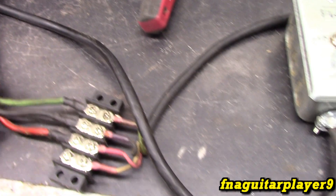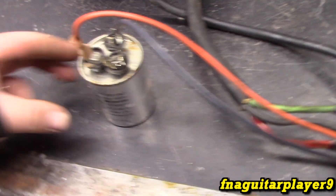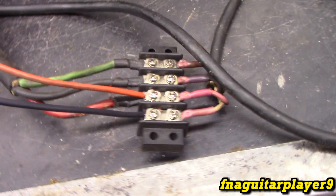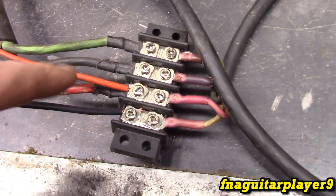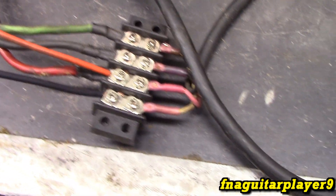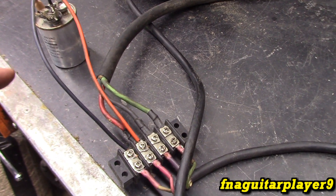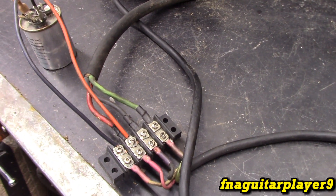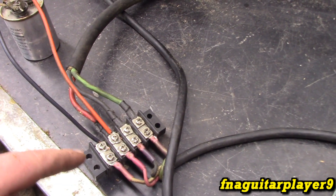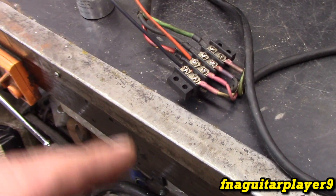Let me get this set up and I'll show you what I came up with. It's the same motor wired up the same way, and now I've got this capacitor hooked up — a run capacitor — hooked up across either one of those phases, connected to the third phase. What this is doing is acting like a phase shifter. It's shifting the phase of the voltage, which is what a capacitor does on an AC circuit like this, so it actually simulates a third phase.